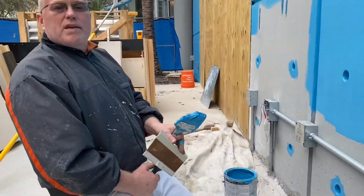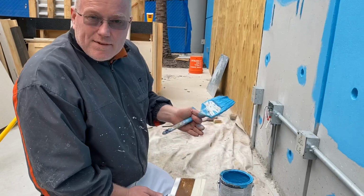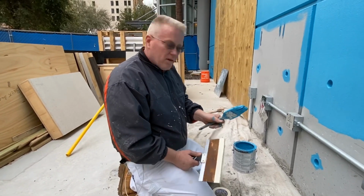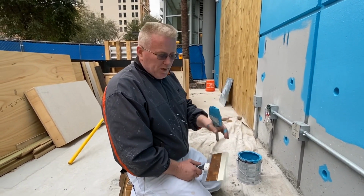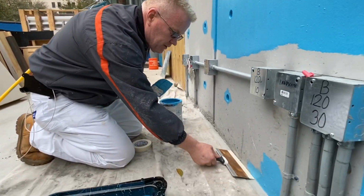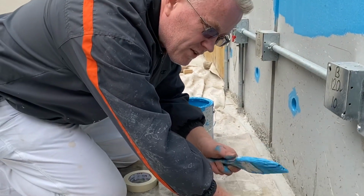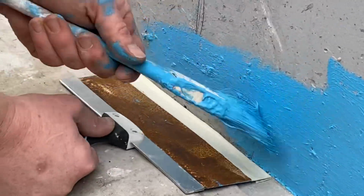If you think about it, we need something that fills in those nooks and crannies and doesn't permit the paint to get underneath it, right? So I put 4 layers of tape on this 10-inch taping knife with a very moderately wet brush, not sopping wet or dripping. I take the spatula, and you see, if you put a lot of tape on it, it sort of conforms to the nooks and crannies. If you can just do a zoom and close up, we'll show them how this little technique works, whether good or bad.